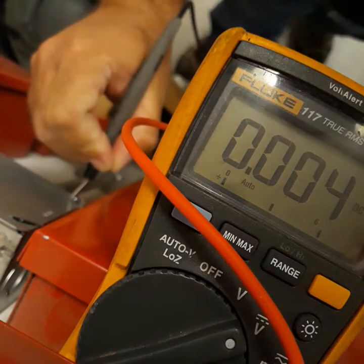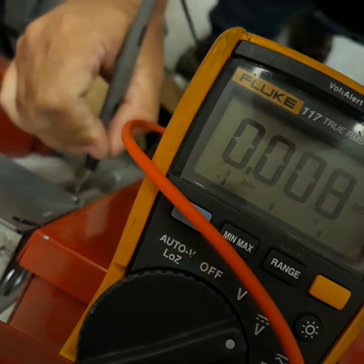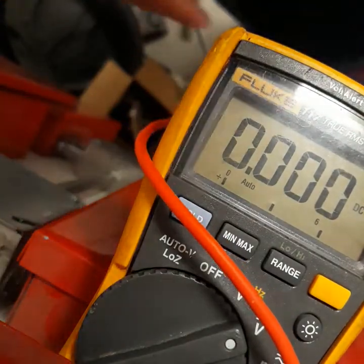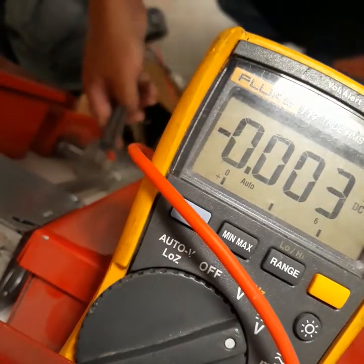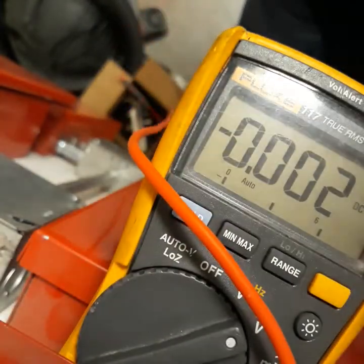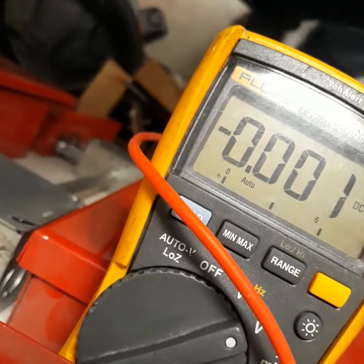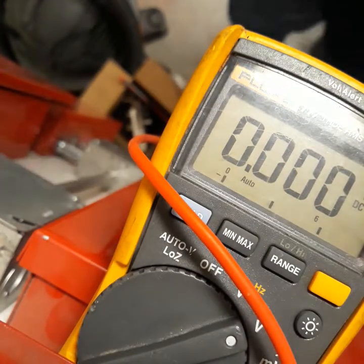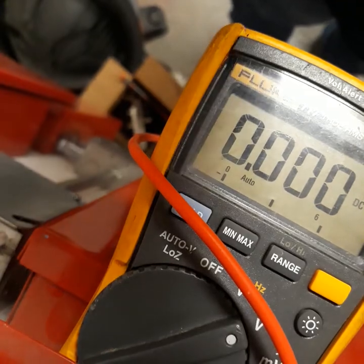Then I come over and go to the next leg — it's got 19 to 20. So that tells me my ground fault is on that wire right there. I'm going to have to take both legs loose because it's only got a 4.6k ohm resistor, and this panel will read that ground fault across both legs. But you can read it with your meter.